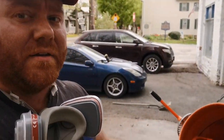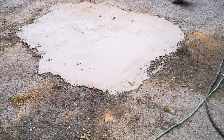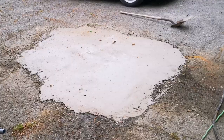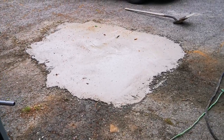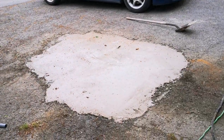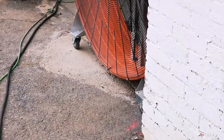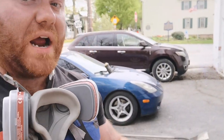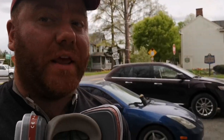So thumbs up on the machine. And you guys learned how to do a quick DIY patch on a driveway. I think this repair is gonna last forever? Absolutely not. You are not really supposed to — unless you have special bonding agents — put concrete over asphalt. However, if you're like me and you're just trying to buy yourself a couple years out of a driveway, this is a perfect DIY fix. I have another little concrete patch over there in front of the shop that I did about six months ago and it's still holding up great. If you guys want to see part two of this driveway restoration, like and subscribe. We're going to be doing a full video on the whole driveway — surfacer, sealer, fixing little cracks — and get it all on video. New videos every week.